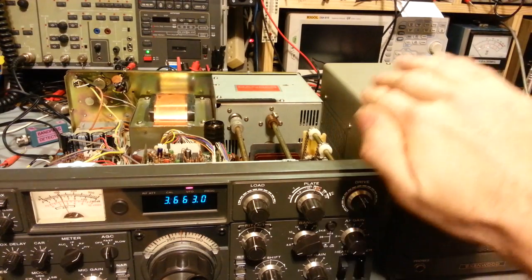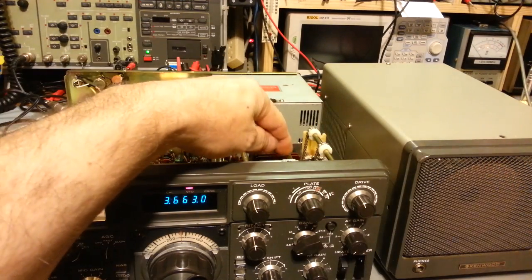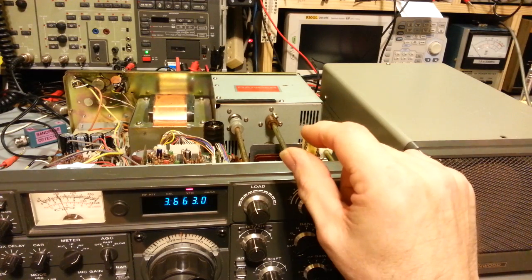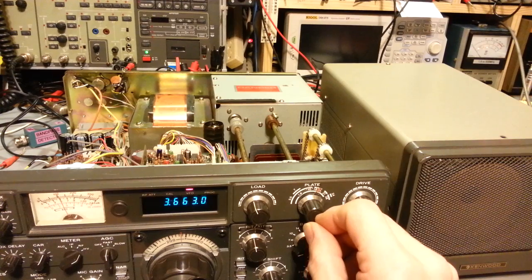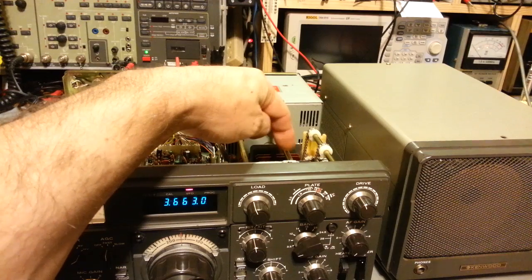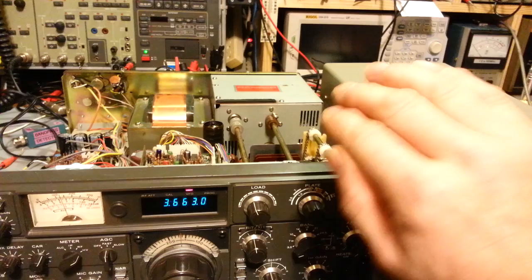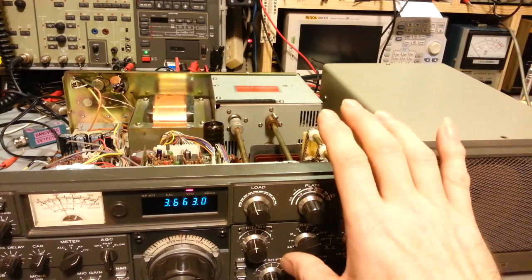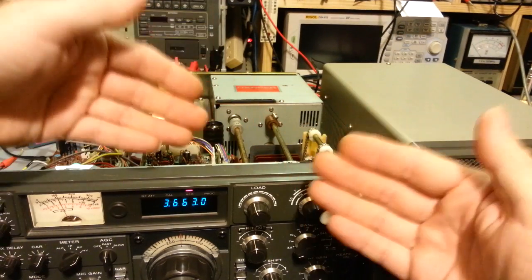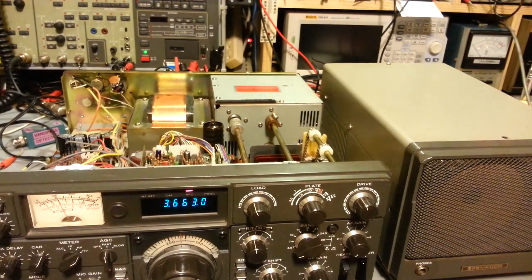Make a mental note of where that notch is, basically where it scratched the surface of the shaft on the rear section. Put your coupler in, try to line up the set screw with that mark, and then slide your front shaft back in, and make sure you get the same thing, that deformity, I guess you could call it, where the set screw has marred the surface of the shaft. When you push it back in, make sure it's also in line. When the person put this one back together, if they'd paid attention to that and made sure those two spots were perfectly in line, they would have also noticed that the flats of the shafts were in line. One wasn't like this and the other one, and that's why it was all screwed up.